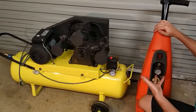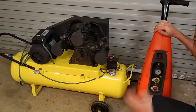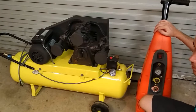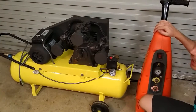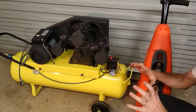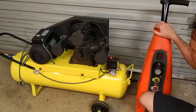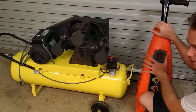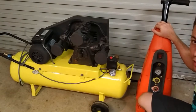It's completely fine to do powder coating with. It still charges up to 90 psi so you will need the regulator. It just cuts in and out a lot more. But when it comes to powder coating, you don't need lots of air — it's down at that low level so you're not expelling large amounts. This is going to work completely fine. You might even have one of those little disc air compressors — they'll work completely fine too. So get yourself some air, a regulator and an inline filter and you should be good to go.